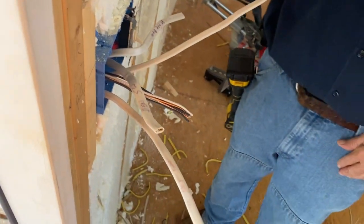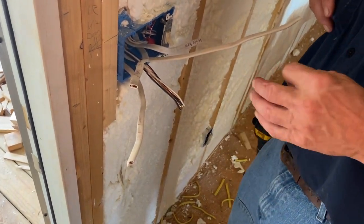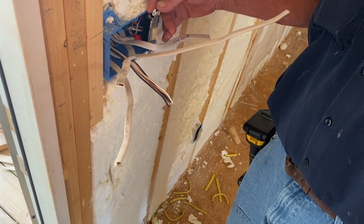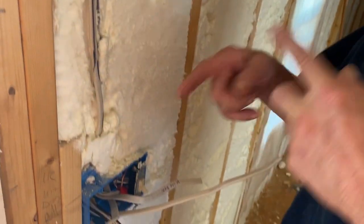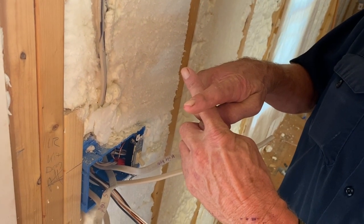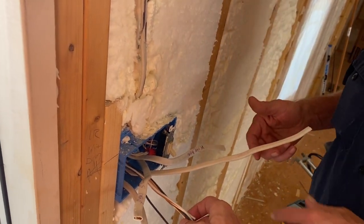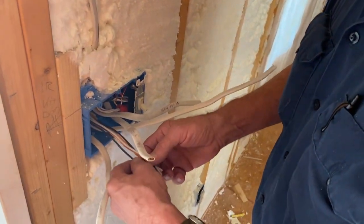And three-way switches, doing this is because you have a common, which on one three-way switch is the power wire. Common from the other three-way switch goes to the light. And then the other two on there are travelers. They just go between the two switches, for power, because you flip it one down, it makes to one side. You flip it the other way, it makes to that side. And then the bare ground just all twist together, and one goes to each switch.